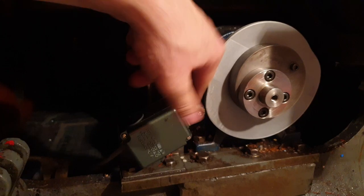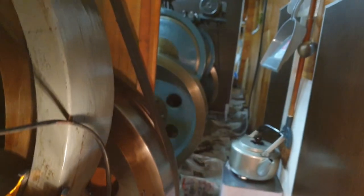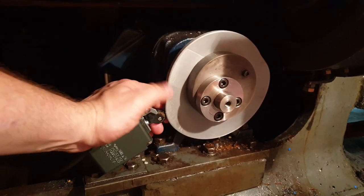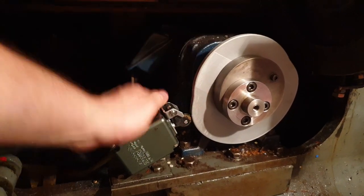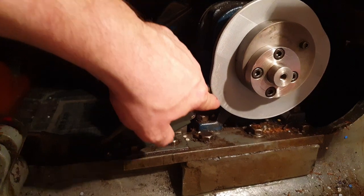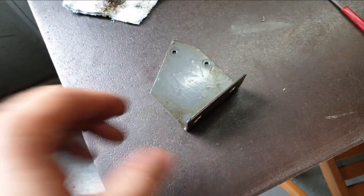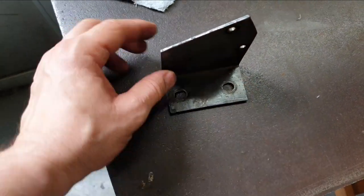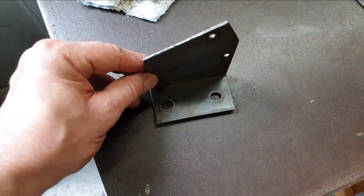Alright, so I'm just giving this thing a bit of a spin just to see if we've got no binding, and it turns out we do. I've made this as close as I could to the original design, but it may be slightly different because it was all worn out. I could have taken one from that machine that's slowly idling there, but it means that would have been out of production, and I didn't want to put an extra machine out of production for a few days. It looks like this here is a bit close — it's pushed all the way in and it's not at the top of the curve there yet. So this needs to move back by a millimetre or two. We might have some adjustment here on these two bolts down the bottom. So there's our bracket — you can see there's a little bit of adjustment here, just a millimetre or two. I'm just going to file just here and just here so we can move that away a bit further. I could redesign the part, but I want to get the machine working now. Enlarging the slot will give us more adjustment in the future as well anyway.